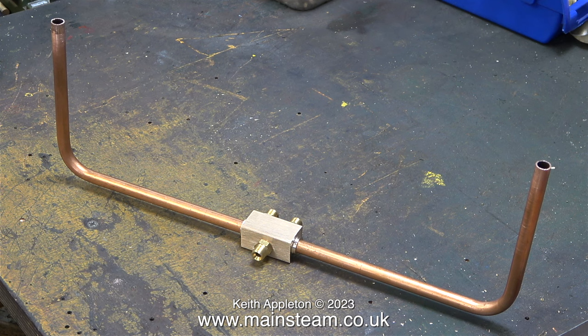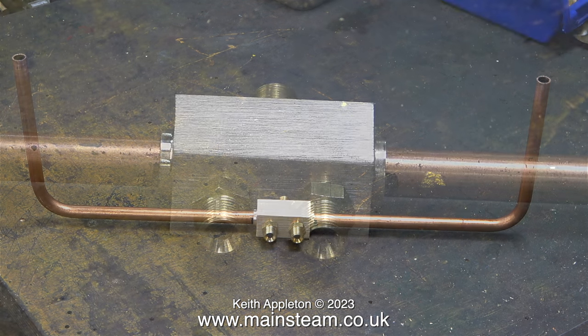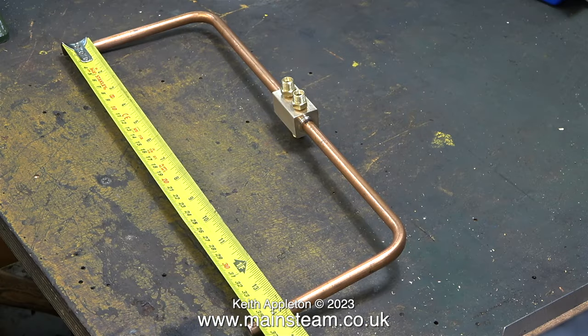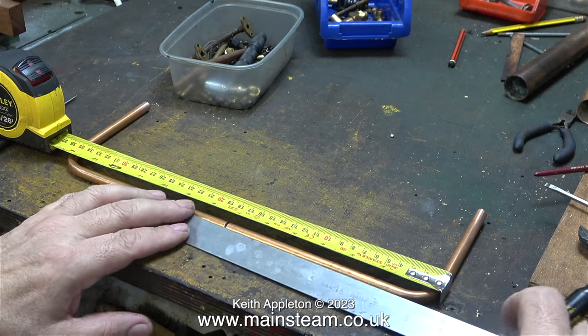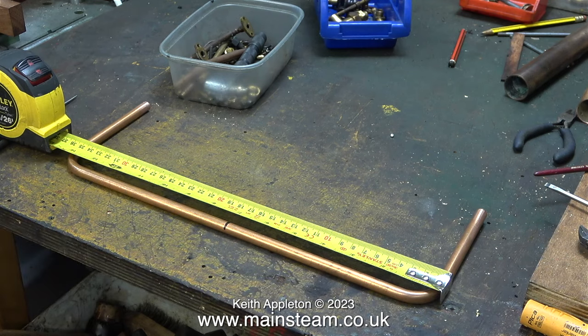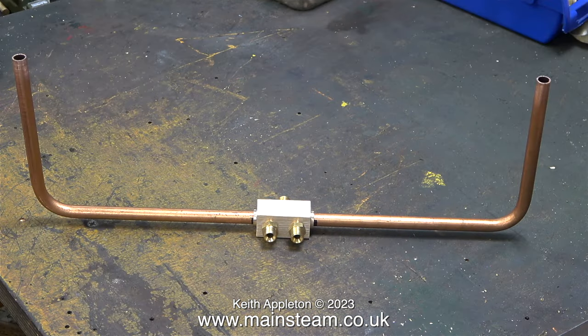I need to determine how far to press the balancing pipes into the fitting. The answer is simple: I made some marks on the balancing pipe using a felt tip pen — these are the external positions for the pipe. The next thing to do is use the tape measure in exactly the same way as I did previously before I cut the pipe — it is 14 inches to the outside edge of the pipe. Here is a clip from the last episode showing me measuring the part twice, applying the logic: measure twice and cut once. And that is it for this episode — as always, stay safe, stay healthy, thanks for watching and I hope you found it useful.